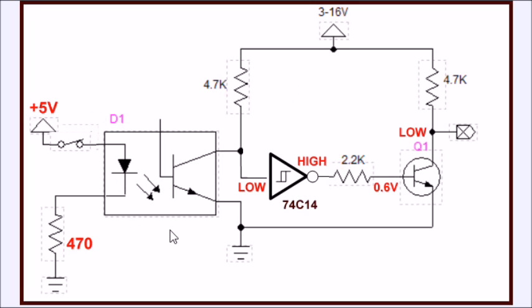Here is the equivalent circuit that I actually constructed using a standard transistor output optocoupler. The LED turns on, the phototransistor switches on, and produces a low. This is a 74C14 Schmitt trigger inverter — it will go high and switch on Q1, which then goes low. You could build one yourself if you wanted to, though it's hardly worth it.